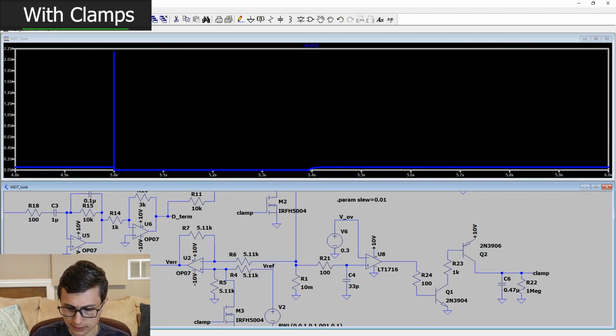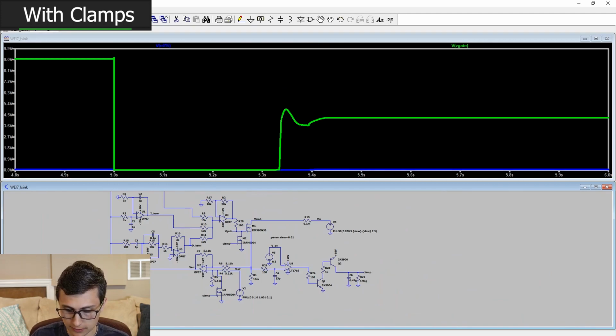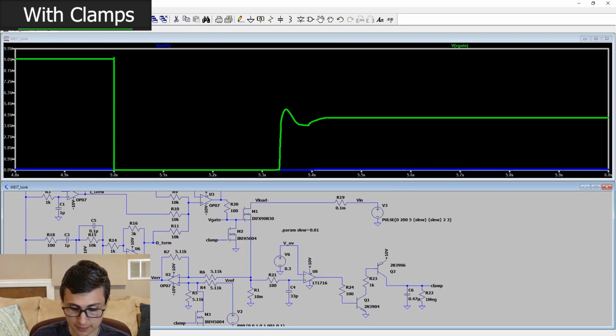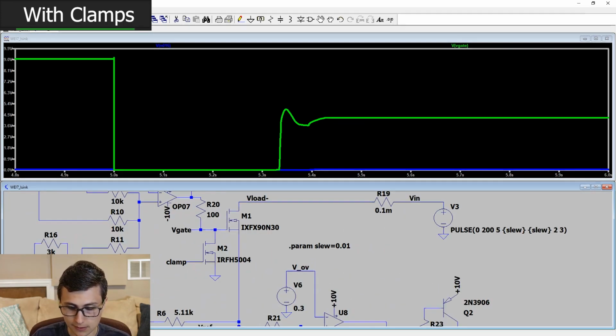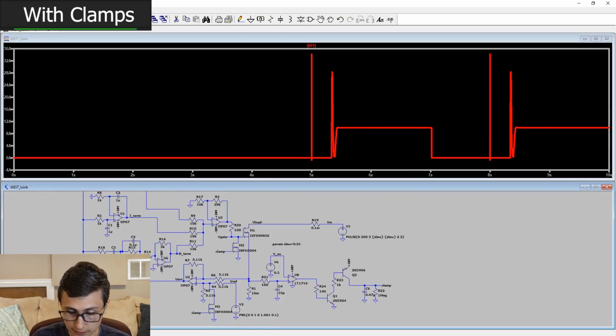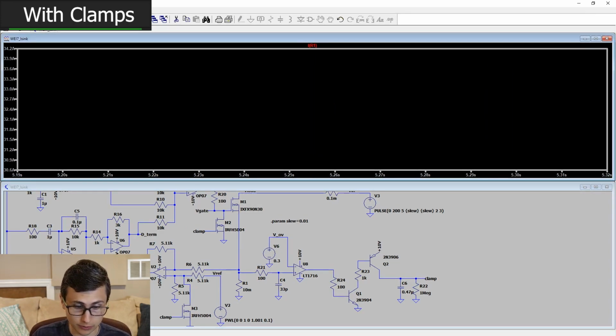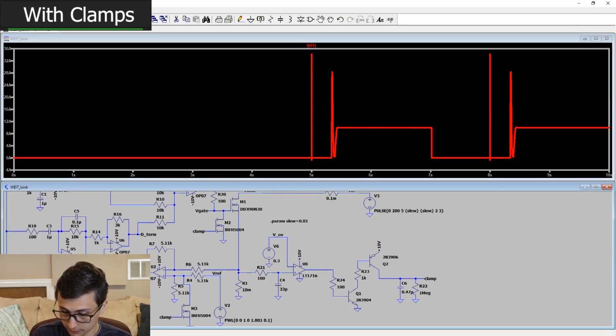So we basically take our reference, we just clamp that right to 0, take the gate, clamp that right to ground, basically turn off our output FET by applying about, well, negative however many volts are across this current shunt, and wait the fault time and then re-enable. That's fantastic. So that's the fault timer that we added. And typically this would be set, in this case it's set 5 amps above our nominal current, so it leaves a little bit of room for that overshoot and ringing under normal conditions. And that actually allows us to reset. We get pretty close to tripping again. But we don't.